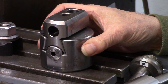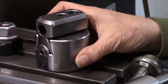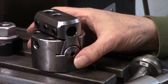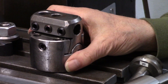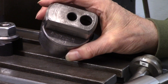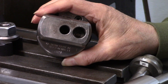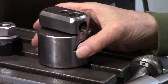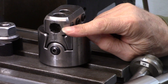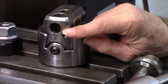Today's video is not about the milling machine, but rather about this boring head. I was very lucky to find this boring head at a tool sale. It's a Flynn boring head. It has some nice features — it receives half-inch and five-eighths shank boring bits in the top and in the side. It receives five-eighths bits and also half-inch square, which are both compatible to the same size.